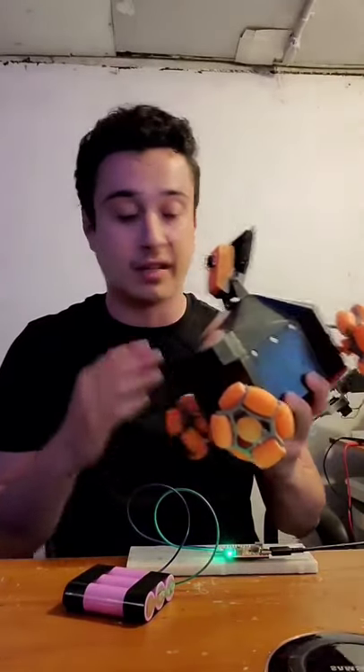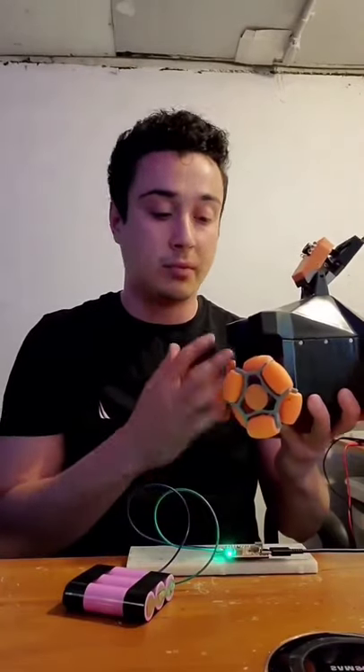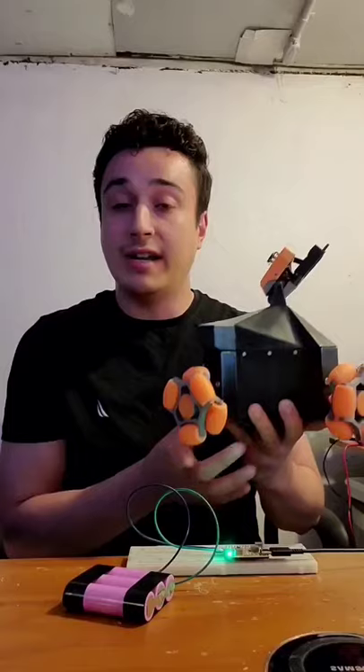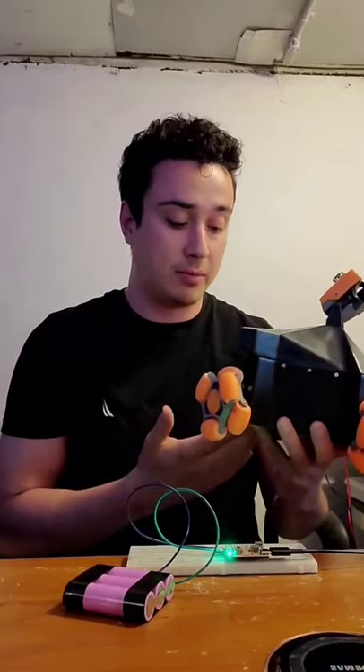This thing is great for an assortment of different projects that use high amperage, for example some of my robots. One of the biggest problems I have when making a new robot is power consumption, and Podair 2 here is no exception. This thing has 4 motors to control its wheels, 2 infrared sensors, 2 cameras, an amplified speaker on the back, and 2 microprocessors — one controls the motors and sensors, and another is a microcomputer which boots Windows 10. One of the biggest problems I have sometimes is when the motors are running at full speed along with the speaker, cameras, and sensors — you can have power failures that cause the microprocessors to spontaneously shut off, and that creates a lot of problems.